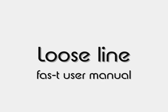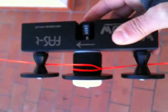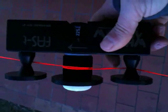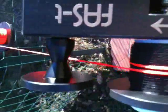However, if the line is loose, the adequate measurement will be when the line is just turning completely 180 degrees. In this case, the recommended technique is just to wrap the line around the center part. It will also spin freely, but it will make more accurate measurements even if you move at slow speeds without having to worry about the line tension. It works really, really well, but you need to practice with all these different line tensions so that you start getting accurate readings and can start making your surveys.